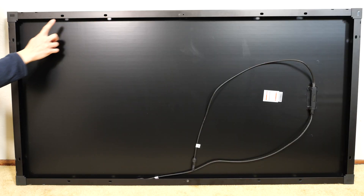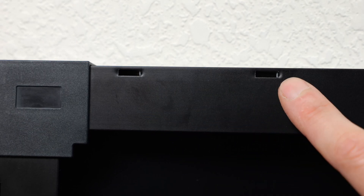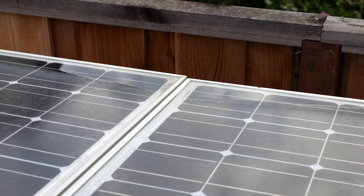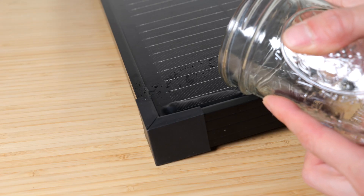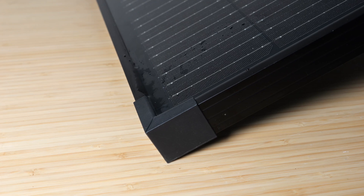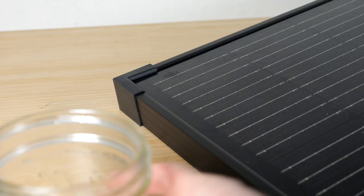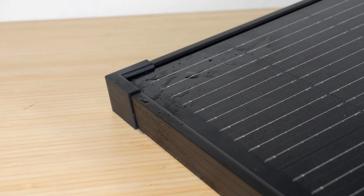There are 12 pre-drilled mounting holes and two grounding screw holes. These little rectangular holes on the corners are drainage holes. There is pooling on my older solar panels — if I pour a little water on here and tilt it to around 30 degrees, you can see it drains away. On the Kalfa panel it just drains away really fast.